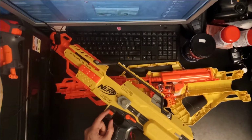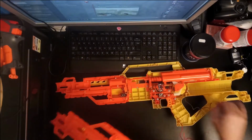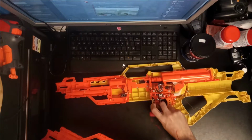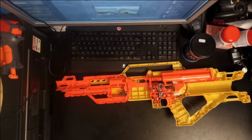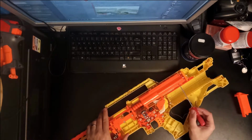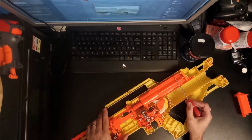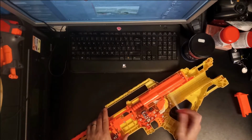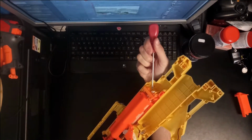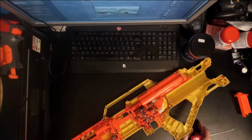That's your mag release there. It fits on that bit, which fits in that square hole there. And when you pull this back, it pulls that back, and releases your mag. It's similar enough to the Springers you know, in that you've got your main spring in here, and it's sandwiched between the back of the plunger tube and the back of the plunger head, so call it internal. Here at the back is the back of the plunger rod, the catch, and the actual trigger catch, call it. However, the way it works is a little bit different.